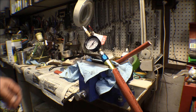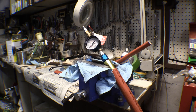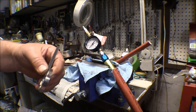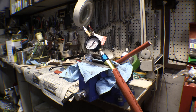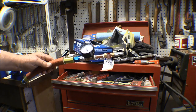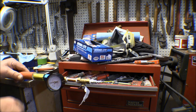I've got the first hose done — got the fire sleeve on it, got both ends on it. I just pressurized it and we've got a little over 50 pounds. We'll let that one sit and test it — make sure it's water tight, air tight, oil tight. It's been under pressure for a couple hours now, staying right at 50 to 55 pounds. Then I'll blow it off, take the fitting off, and do the other one.